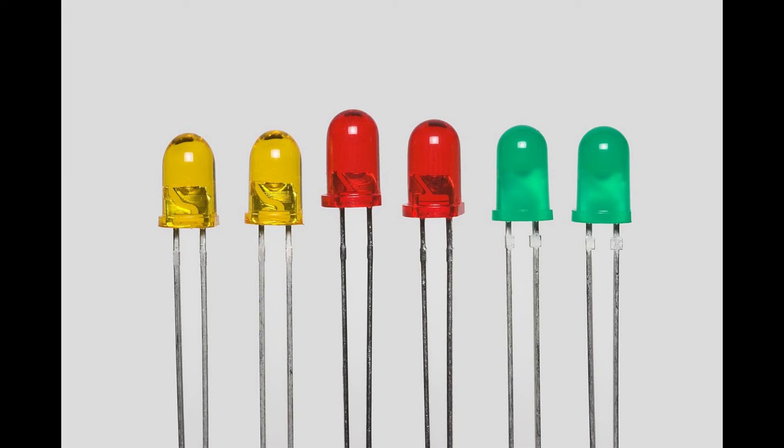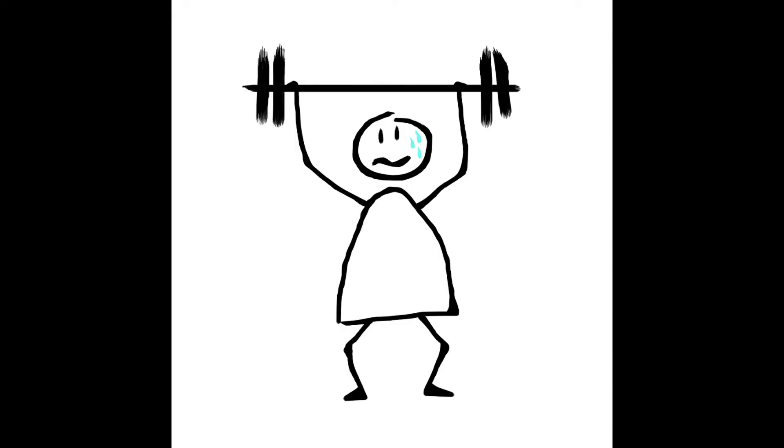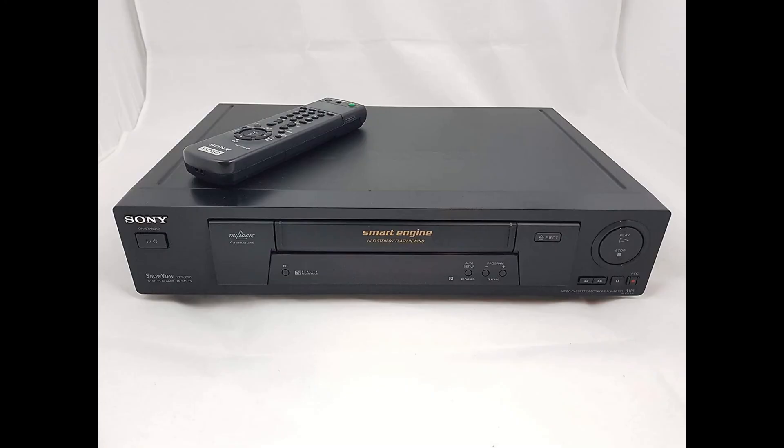The LEDs are easy to replace if you think one has failed — it's the same process as replacing the capacitor. These are quite often driven quite hard so they can fail just due to the abuse they're put through. If you think about the life of a typical remote that's dropped down the side of the sofa and sat on for the length of a movie with the LED constantly illuminated, it's not surprising that these do fail. Anyway, that's it for now. I hope this has been useful. I will get back to some radio-related content at some point in the near future, but probably the next video will be disassembling a VCR and doing some further fault finding — maybe by then I'll have received my new oscilloscope. Thank you and see you next time.